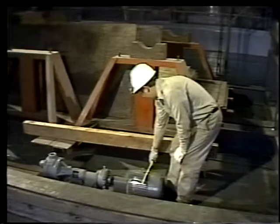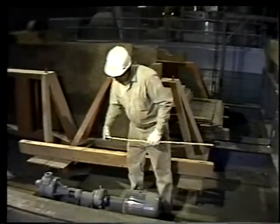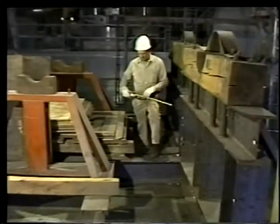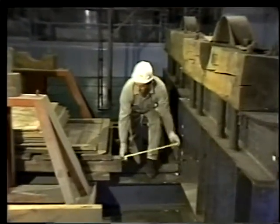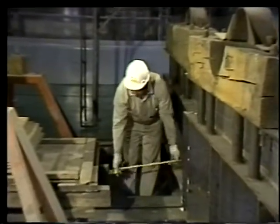There's really only one more thing we have to know. We have to know where we're going with the load and how much room we're going to have. First, check the size of the load. Measure the width to find its smallest dimension. Then measure the length. Measure the width of any tight places along the way, even if they look big enough, to make sure you'll have enough room on the sides to avoid lifting the load above any other equipment.